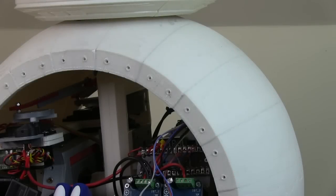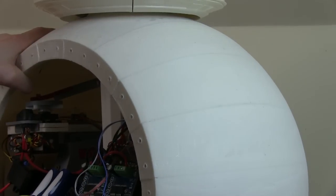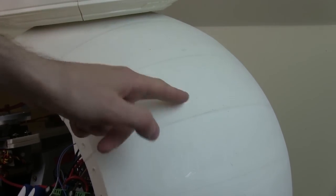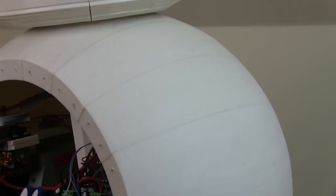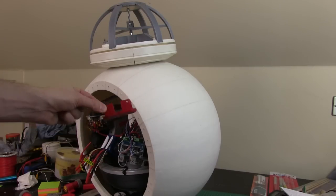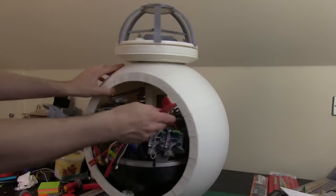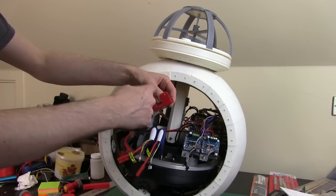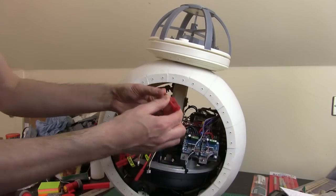There are 20 sections, which means sitting down and getting covered in bits with a vacuum cleaner and this rasp, then sanding for a few hours to get rid of the ridges all around the ball. Then I can change the leverage angles of the servos again and see if we can tune this up. That took several hours to do — very hard work, but it is quite satisfying to see it much smoother now. There are still some flat spots as I've discovered when testing, but it's much better than having a bump on every seam. I've also replaced that semi-flex two-pronged piece with one that goes all the way across in one continuous piece, so there's no gap in the middle allowing it to bend — that's made my head control arm a lot stiffer.